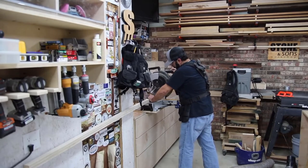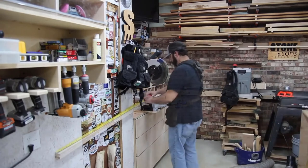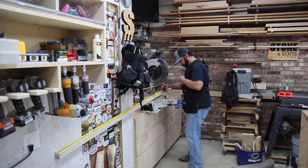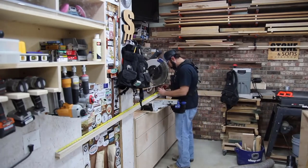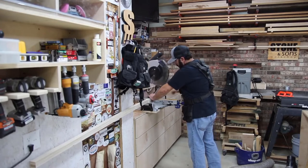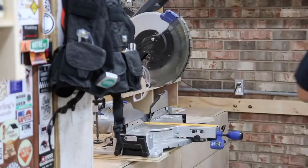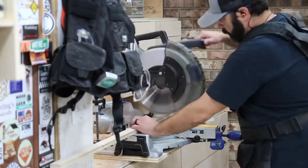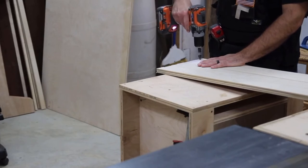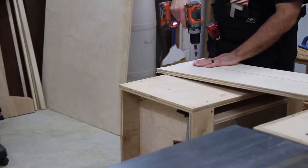With this particular style I'm making the four outside pieces — the two ends and the two sides. But there's gonna be some internal parts to this. I'm cutting strips of plywood on the table saw and cutting them to length. This is going to create an internal section of the bed underneath for support — kind of like where the slats are going to go — but they're all going to be installed beforehand and then there'll be a panel to go on top.